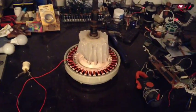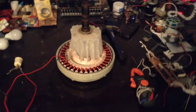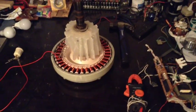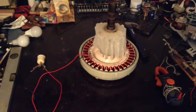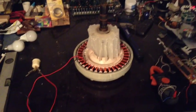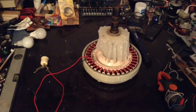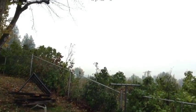That's one reason why we need to have wind as a supplement — if we have no sun for four, five, or six days at a time. So here is a smart drive motor from a washing machine. It's a direct drive motor, not one of the standard AC motors. These things are pretty cool — with some simple rewiring we now have a good DC generator that at 50 to 100 RPMs will give you 20 to 40 volts DC at about two to three amps.